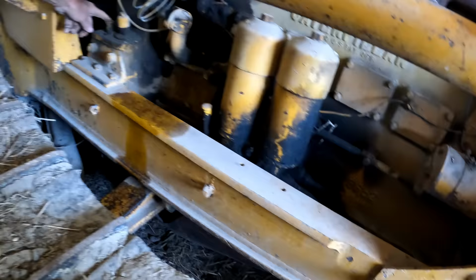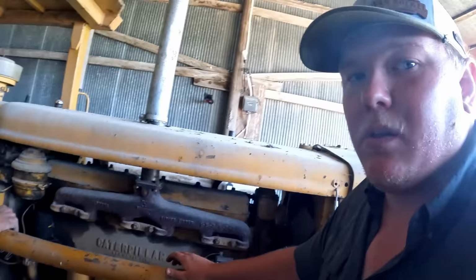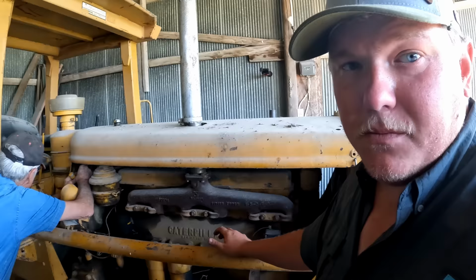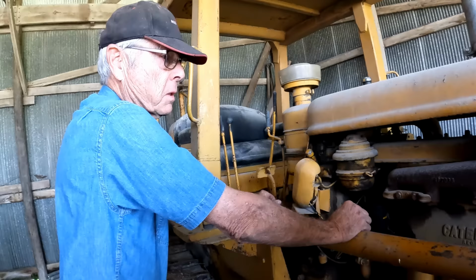There's plenty in there. Typical good old diesel engine. I did stop in town this morning and I got some non-ethanol gas, so not to rag on ethanol, obviously. We want ethanol to be burned and everything, but small engines and long sitting-wise, no alcohol, the better. And older stuff, no alcohol, because gaskets are not made to accept alcohol.